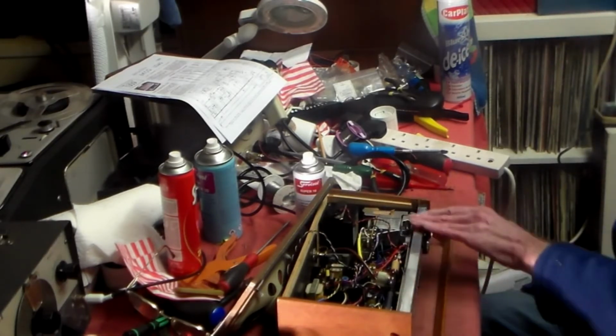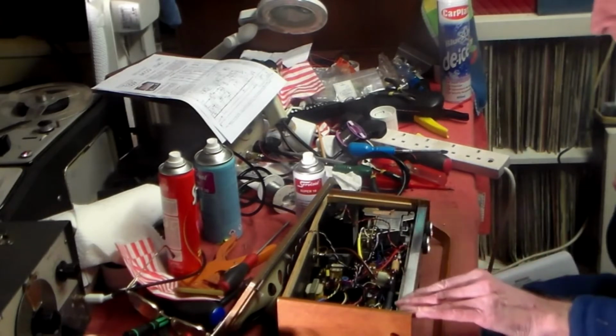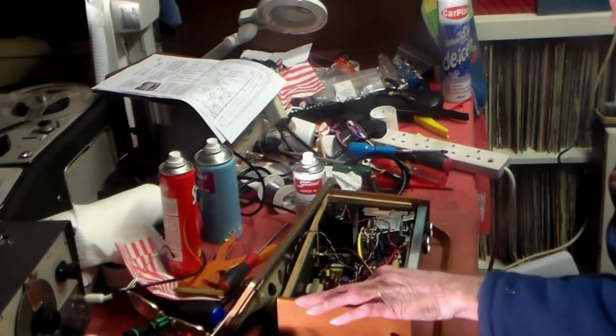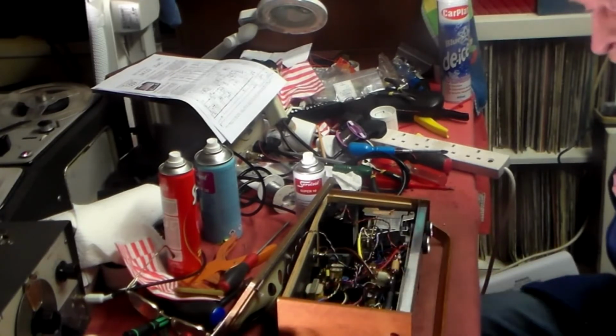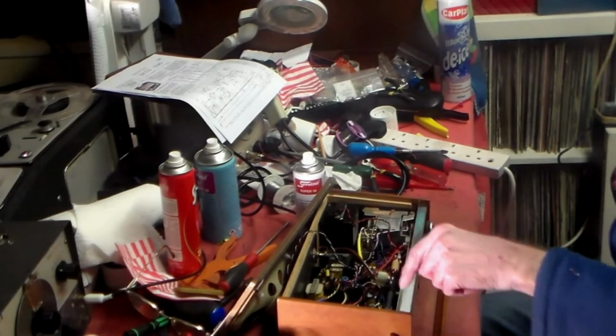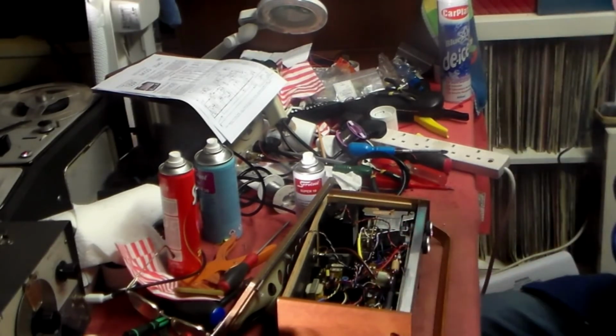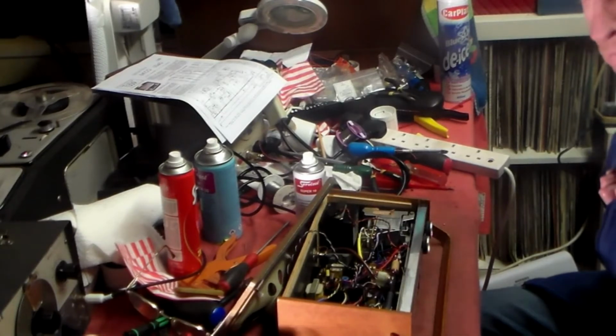Like I said, I was a kid actually, so nice to have another one again. It's an HMV 2148 from 1967 with those capacitors in it. These Collins caps, by the way, they're even worse than Hunts capacitors and paper caps. They are bad. They are supremely bad, and so they have to come out. And then this set will be fine.